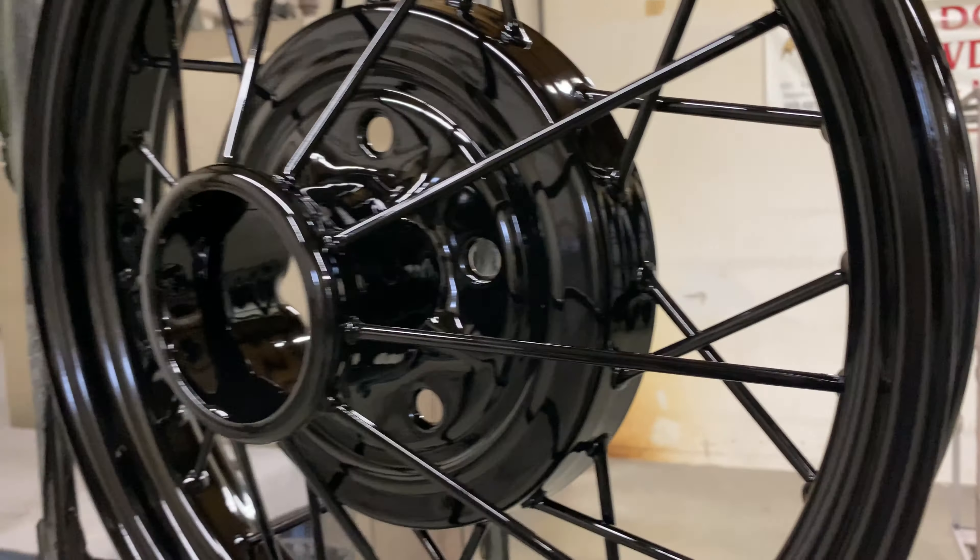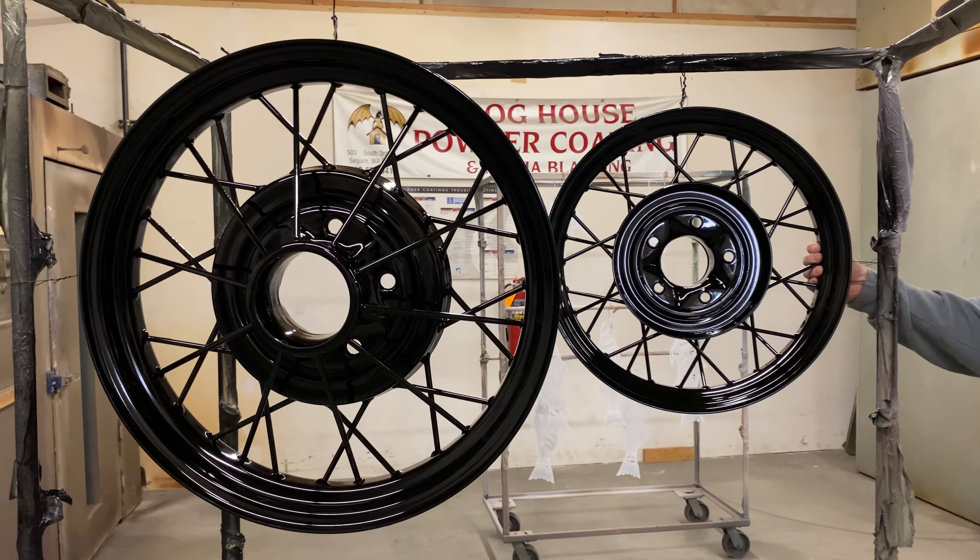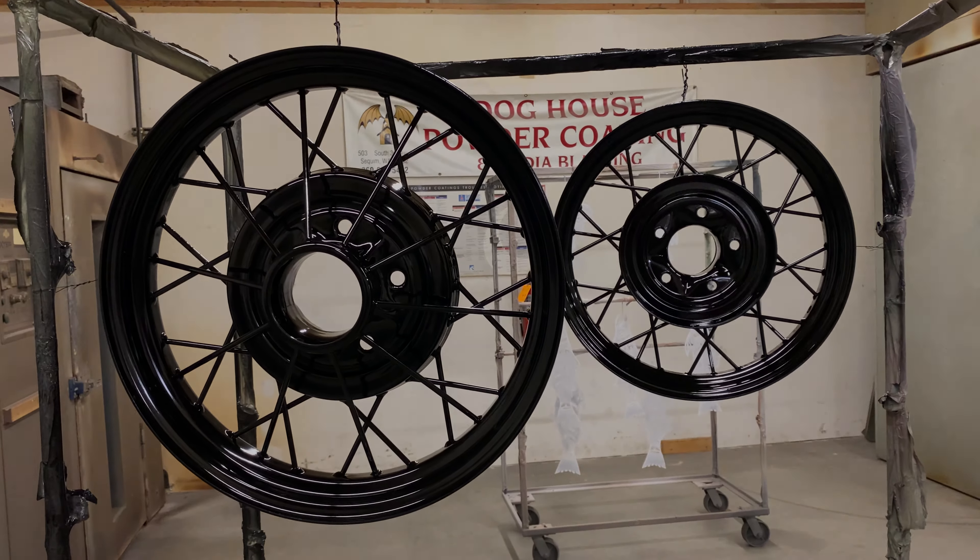You can touch them — they're just a little warm. So they can actually be mounted up now? I'd wait until they're all the way cold before you mount them, because if the powder's still hot it's probably still going to be a little soft. If they're good to handle now, I just wouldn't put any tools to them yet.